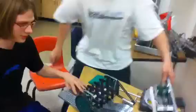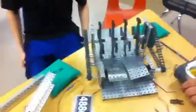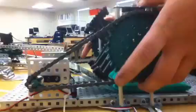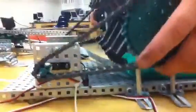For the intake, we already built the intake and connected the motors — it works pretty well. Basically, we have a dead-axle battery setup. We have this chain sprocket ratio right here, which allows us maximum torque. A cool thing is our intakes can also ride up with our bands, and the gear ratios stay the same because the chain just pivots. Now I'm going to intake some sacks — it intakes them really well. I can intake multiple sacks and it just pushes them back.